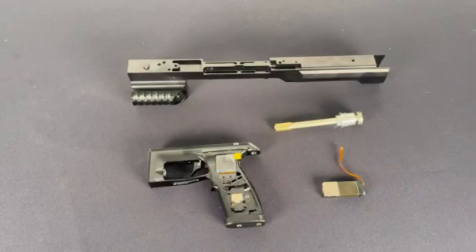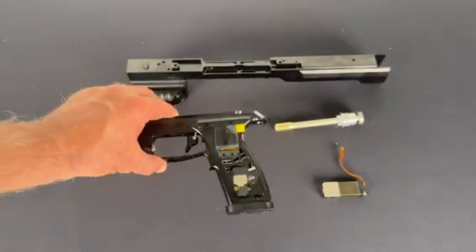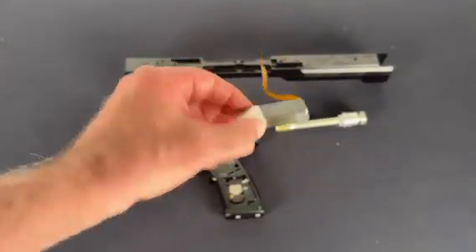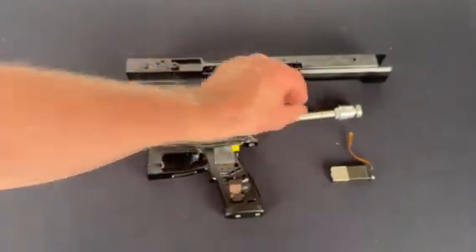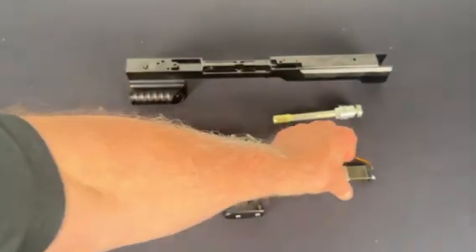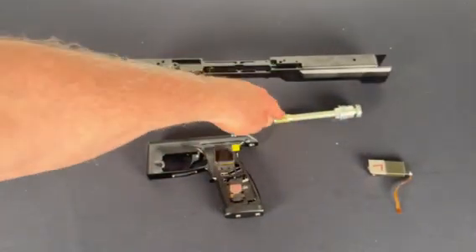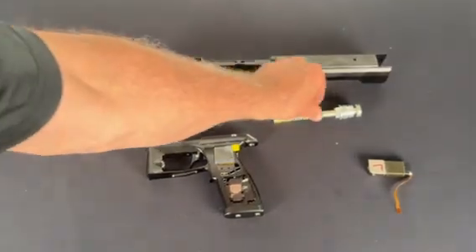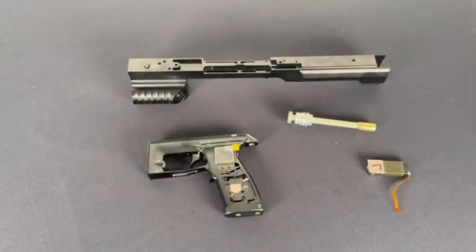So let's take a look at the elements involved in a Scout air rifle. First of all, you've got your trigger assembly, which consists of an electronic board. You have your solenoid valve, which is the guts of what allows this gun to operate and adds to its tremendous reliability. You have the piloted valve itself. So this solenoid valve opens up and shoots a burst of air into that gap, which moves this valve 30 thousandths of an inch. It's the only moving part in the entire system. And then of course we have the lower body which houses the valve right in this area.